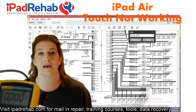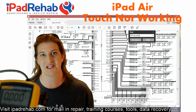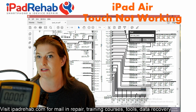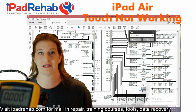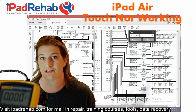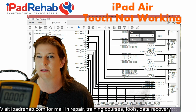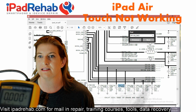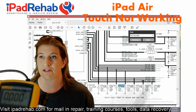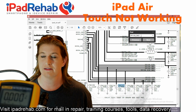All right, so this is undoubtedly the beginning of wherever PP1V8SW2 goes. This is his start, because it's going to be a baby rail of the power management chip. So my question is, is it present right there at the source and then it doesn't make it to the destination? Is there an open line somewhere, or is it never generated? This is a great question to ask. So let's go down to this cap here. If we can find C8137, we can ask that question of PP1V8SW2: are you present out of the PMIC, yes or no? So now we need to copy that C8137 and find out where it is.